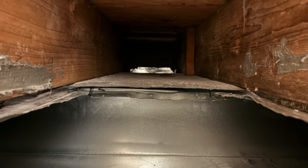You can't measure what's coming through the seams in the ductwork, or through that big hole where someone used the floorboards to pan a return — which we used to do when I started in the trade. Those floor-pan returns leak all the time because it's very hard to seal metal screwed to the bottom of floor joists, unless you just spray caulk over the whole thing.